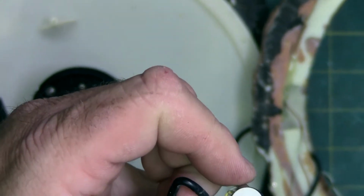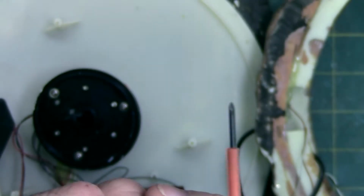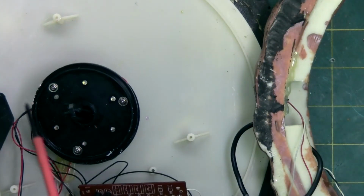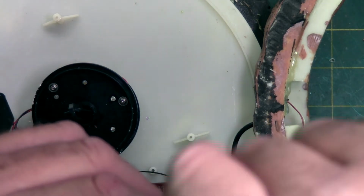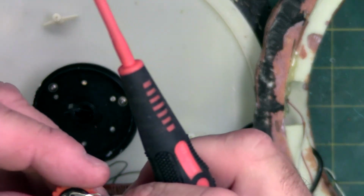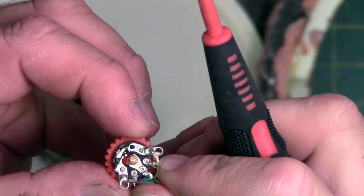When you rotate this with the wheel, there's a ball detent and a spring, which is your click, and it feels weak. And I'm wondering if the ball detent is the problem and the switch is okay. It's just got a weak spring. So I'm going to screw the wheel back on so I can use that versus trying to squeeze that small piece of metal. See how it lifts right here? Here's your click. You notice when I click it back, it's not clicking.